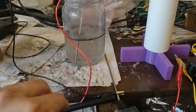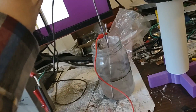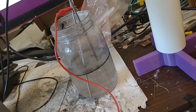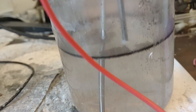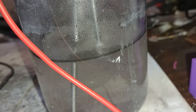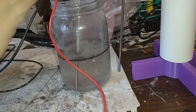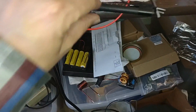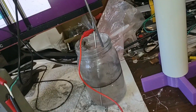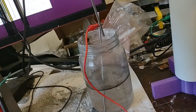The idea is that one of the electrodes — the positive one — is going to be mostly in the water, so I have a low current density around it. And the negative one, or the reducing one, is going to have a high current density because you've got to put very little of it in. Let's put the very tip in. Okay, so no plasma. I've done some other cool experiments with water and electricity, so this seems like a pretty cool one.